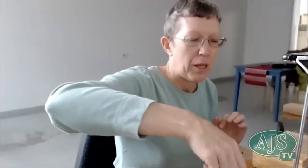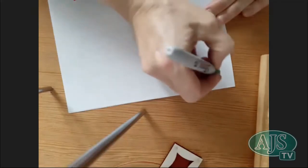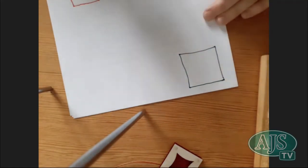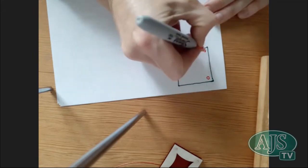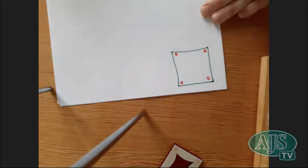All right. So let's start. I've got my drilling block here. Actually, I might draw this. When you're drilling, if you had something that required multiple drill holes, for example in that piece where I've got the four rivets in each corner, it is much, much more difficult to drill through things that are spaced. So this is one of the few times where you may have to drill the holes before you rivet everything.